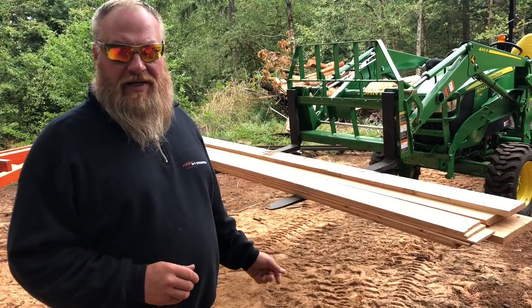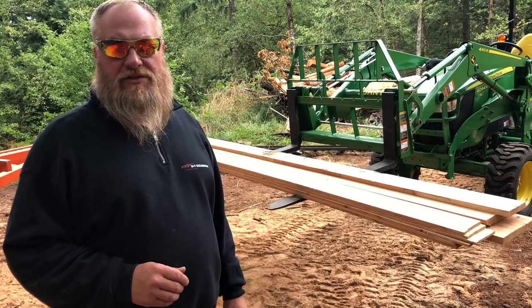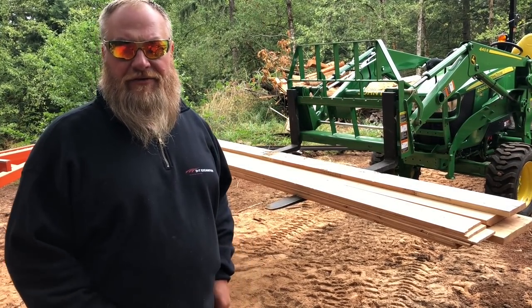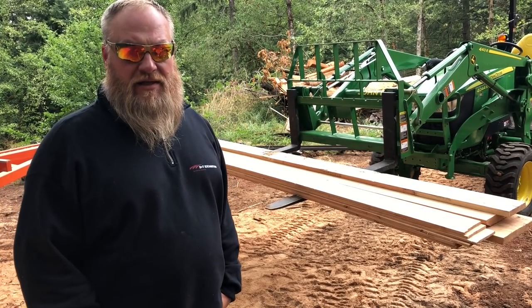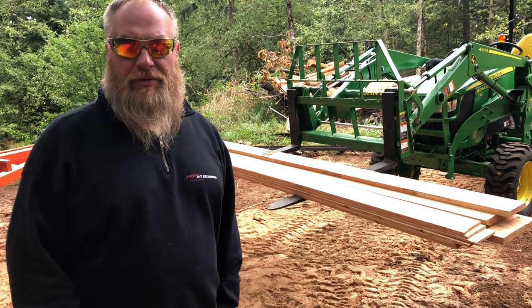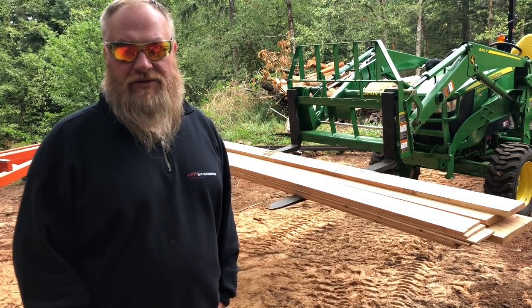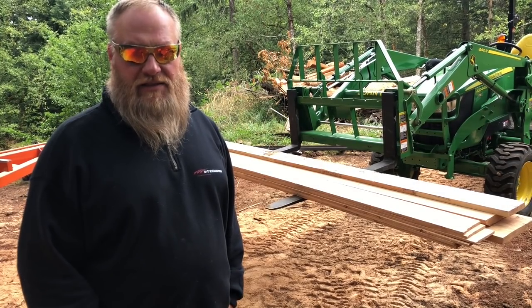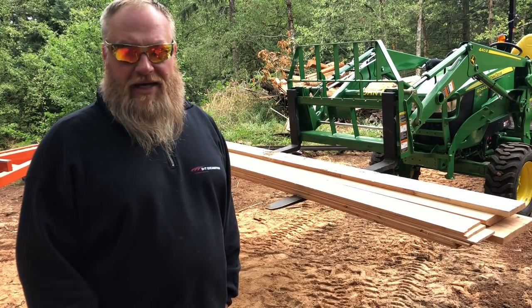Now I've got all the paneling I need. I'm going to cut it into 2.5 foot long tiles, and I'll stagger them on the face of this front desk. I'll cut the tabletops to length and run them through the planer, and then hit the edges with a sander. I'm going to put a clear polyurethane on those, and like I said, a black stain on the panels.